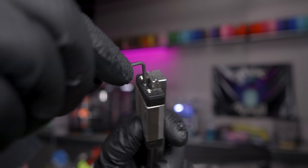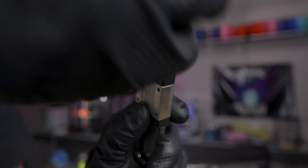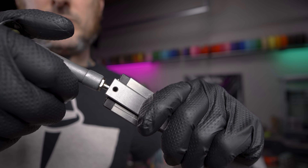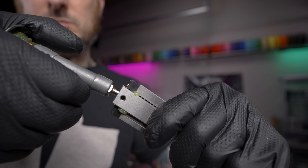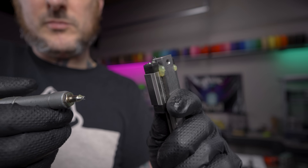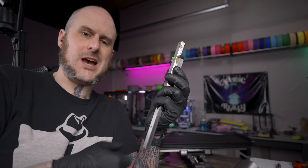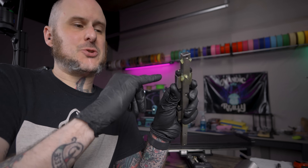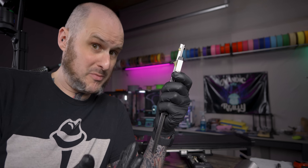These particular MGN15 linear rails for the Milo build have a screw in the end of the dust cap right in the middle. If I take that out, I can inject grease into there and it'll get into the ball bearing passages in the carriage. The idea is to inject a little bit until it comes out of the sides of the carriage, which tells you that you've greased through its passageway. However, I don't really feel like this gets the entire carriage — you'd have to do it numerous times sliding it back and forth, and it also means getting it toward the end of the rail with the stop removed, risking it sliding off and losing ball bearings.